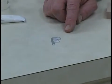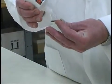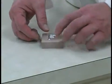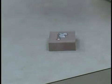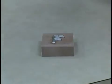Superglues are also very convenient for gluing pattern letters onto a pattern, be it wood, metal, or tooling plastic. Here we're gluing a white metal pattern letter to a piece of wrench shape. With only a couple of drops, the letter is laid into position easily.